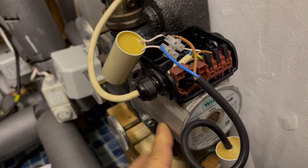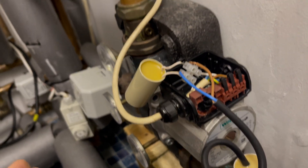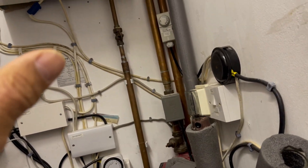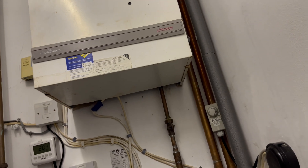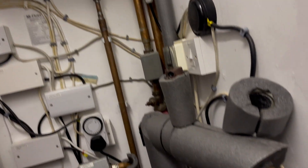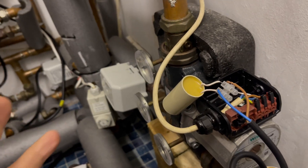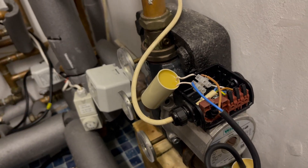As a result there's less current flowing to the motor, so it runs a lot slower. If it was on your boiler you'd probably notice that your boiler keeps cutting in and out, not able to get rid of the heat it's generating. The furthest radiator in your house may be a little bit colder and stay colder for a lot longer compared to the nearer ones.